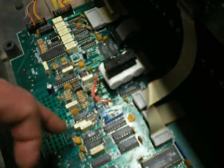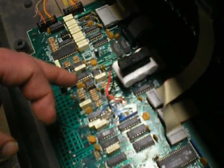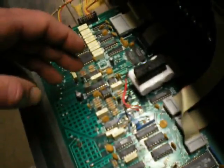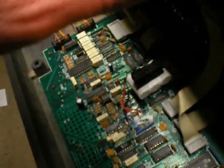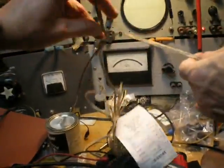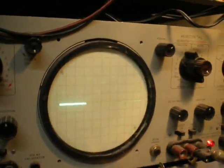Test point 8 — where is it? It's right there, right on the battery next to that connector I stuck in there. That is your signal coming in from the panel. You should be able to see your voltages going all over the place depending on what the knobs are set at — you can turn them and see them do that. Should we show them that, Jim? We've got an oscilloscope probe here, we can show them that signal. If I put this on here — okay, Jim, why don't you turn a knob, anything? Turn the release knob up and down. Yeah, you can see stuff going up and down there.